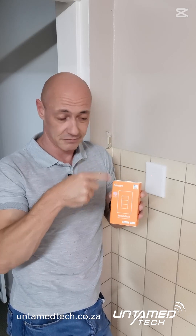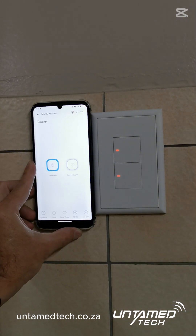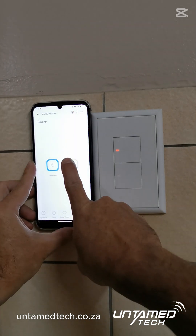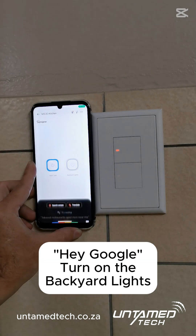Let me explain in a bit more detail. Historically, almost every single house in South Africa needs a neutral wire, which means you have to pay for labor and wiring, making installation costs not cheap. But this is a straight swap because it doesn't need a neutral wire. Here's a quick demonstration: you still have a physical button — you can see it turns on, turns off — or you can press a button in the app, or you can just ask Google to turn on the backyard lights.